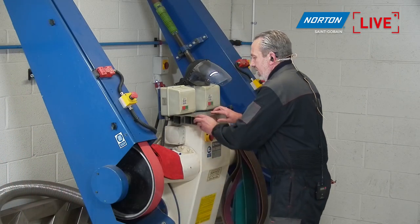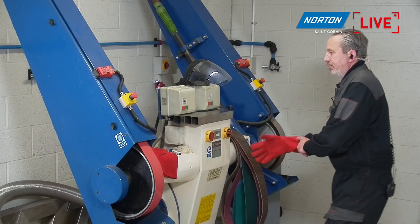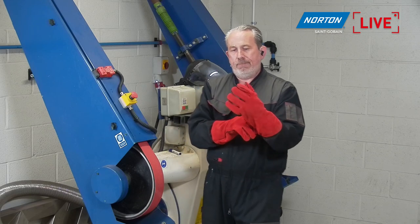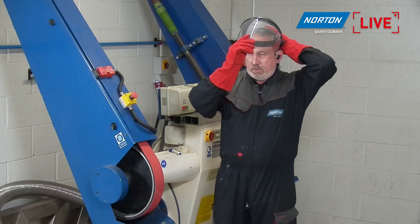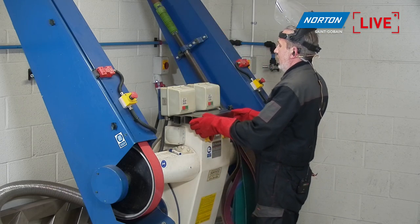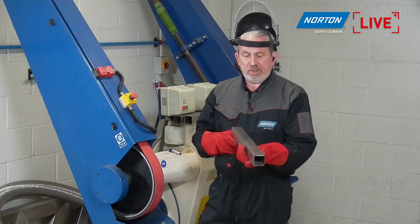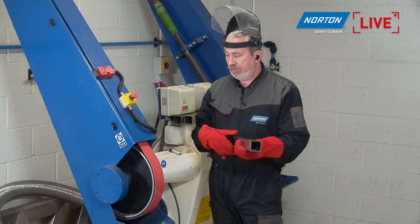Okay, great. Right, let me get my PPE on. Anything to add, Robin? No, you've covered quite a lot already there, Paul, with the explanations. So just to emphasize again about the supersize on the belt that you're just about to use. Very important point to highlight again that you want to keep the metal cool, and that supersize coating on the belt does exactly that. Yeah, it does indeed. Heat is our enemy with stainless steel. It really does react badly, and it can go blue or brown in color if we put too much heat in it. So we want to be quick and light, and not to damage the surface.